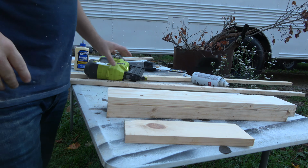Next step is applying wood putty. I mix just a tiny bit of water in to make it a bit more soupy, as I feel this makes it easier to use. The idea here is to completely fill the crack and any holes, then leave just a bit of excess that can be sanded off later. Depending on the preferred level of perfection, sometimes it requires more than one application. I have a fancy Bondo scraper I'm using, but an old credit card works just fine for this.